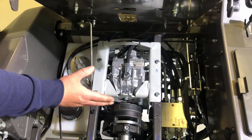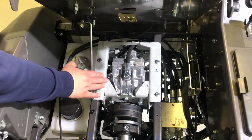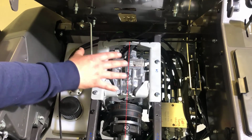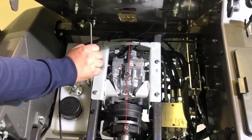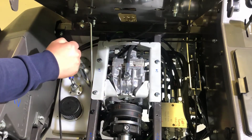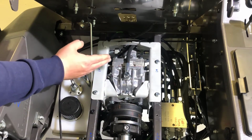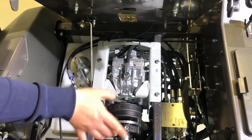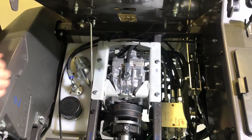We have a new PTO system together with the new PTO bracket. This new system allows us to align the pump together with the engine better in production. This gives us a longer lifetime for the electric clutch and also the belt. Together with the new engine bed, we have a low vibration system.